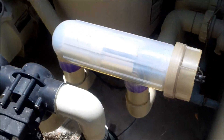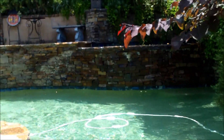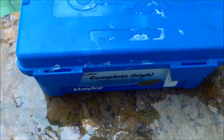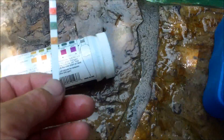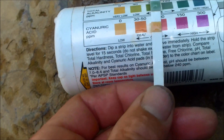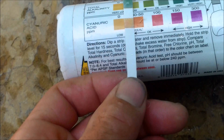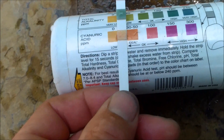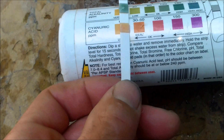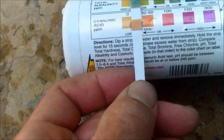Now a saltwater pool — I'll show you the conditioner level in a typical saltwater pool system. I'm going to use both the AquaCheck and the Taylor Test Kit to test the conditioner, so I have something to base it on. You can see the conditioner level here is a little bit low. In a saltwater pool, nothing is going into the pool that would raise the conditioner level, so you have to add it manually with either liquid conditioner or granular cyanuric acid. It's a little below 30.